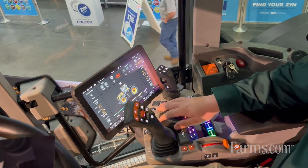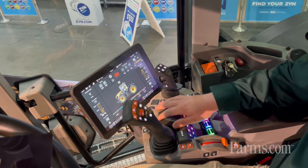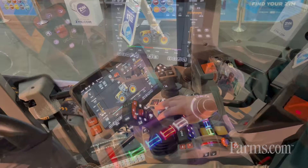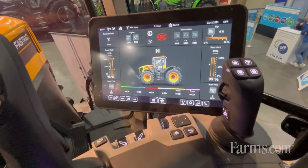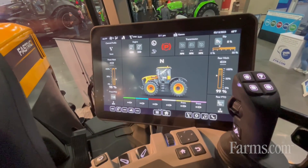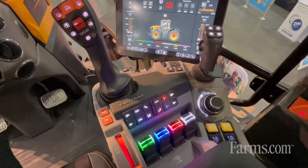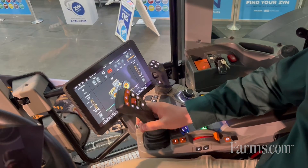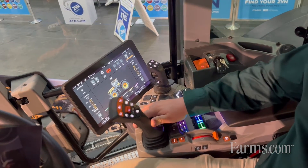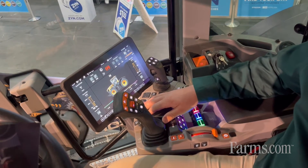The third new feature of the FastTrack Icon is iControl. This is a new software that we call Smart Transmission Control. It's a speed-based system where the driver selects the desired forward speed and the tractor controls the speed and transmission ratio, maintaining the required speed under changing loads. You can also change the joystick pattern from the old increased/decreased speed to increasing speed by pushing forward on the joystick and decreasing speed by pulling backwards.